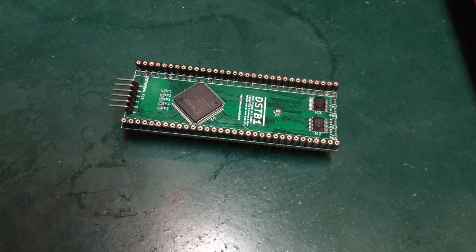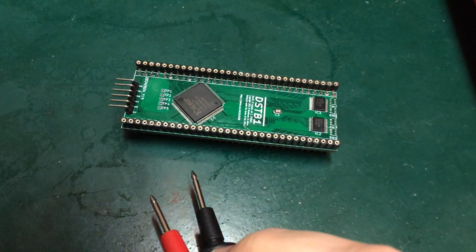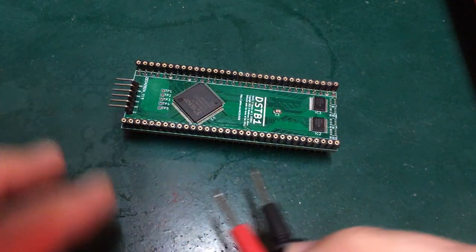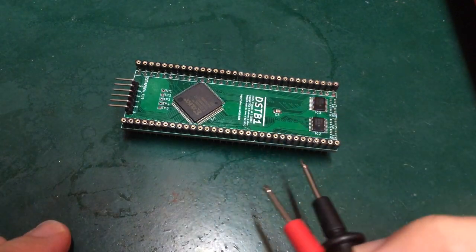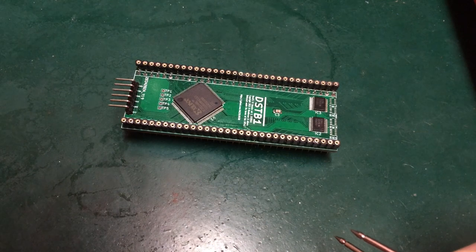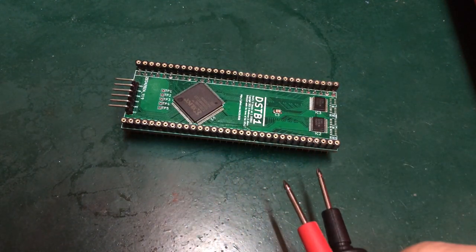Okay, so my enormous Tower of Babel did manage to boot. We did have an intermittent fault with a couple of the address lines, having a bit of a short on them. It didn't happen all the time, but as it got warmer, or I moved it around slightly, I'd basically get a screen instead of the boot screen. I'd get rows of alternating colour 16 pixels wide. That did give away that there's something up with either one of the data bits or one of the address lines. So I took it apart, resoldered it, cleaned it up a bit. That seems to be sorted out.